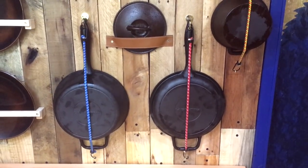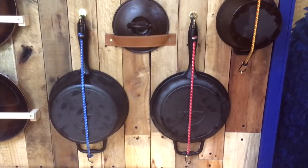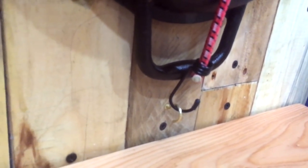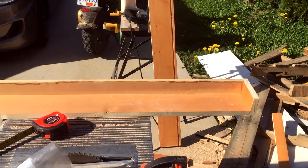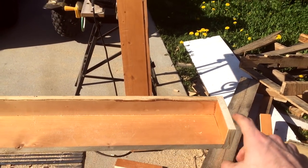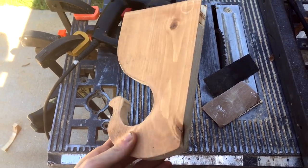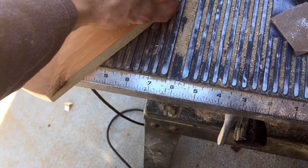These pots were moving around even though the van wasn't going anywhere, so I realized I needed to secure them. I've run a bungee cord from the hooks all the way down to a little cup hook at the bottom, which is actually upside down. I've also cut down this shelf — which was part of a bookshelf I took apart for lumber — and added a little end piece that's going to hold mason jars up in the kitchen. There's an L bracket I've made that could also hold towels, and a notch cut out at the back where the L bracket slots into place.